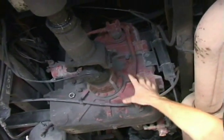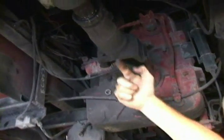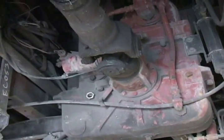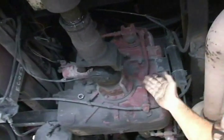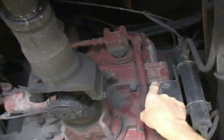This is the back side of the transfer case. You can see that the rear drive shaft comes through the transfer case, so when you're in road mode, the transmission drives through both of the drive shafts all the way to the back wheels. But when we shift from road to pump, the power goes from the front drive shaft through a chain up into this area, which is attached to the shaft that holds the impeller that pumps the water.